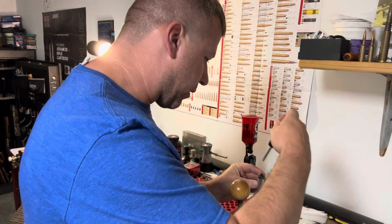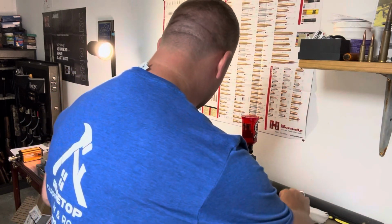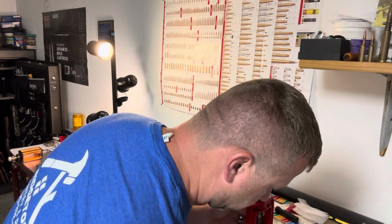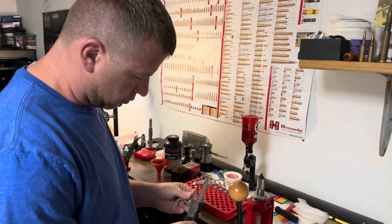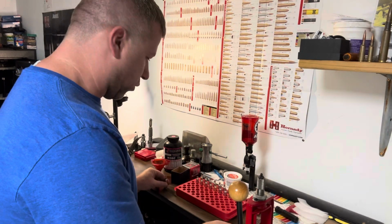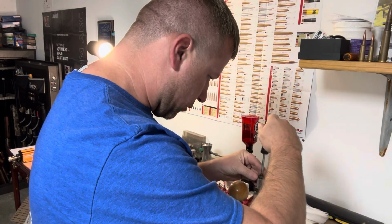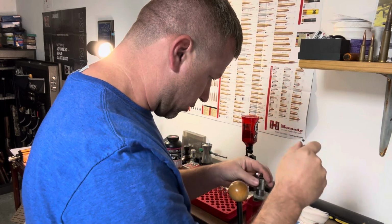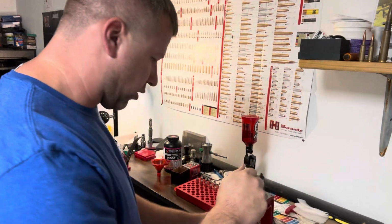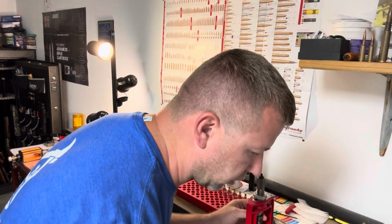So back that nut back off. You put that straight in line with that. Let's see where we're at now. That moved to 2 thou, so we're about 6 thou off from where we need to be. So let's move it about right there. If it goes a little bit shorter, that's perfectly fine. This is just saying what the cartridge overall length should be for this, for just a semi run of the mill.